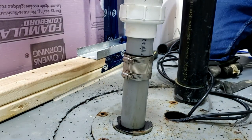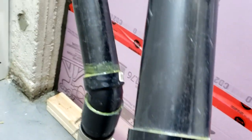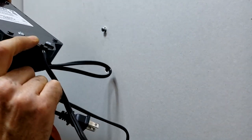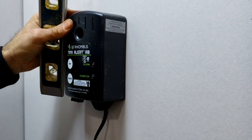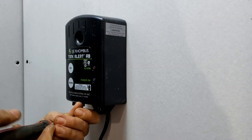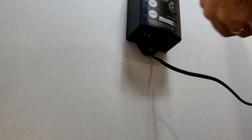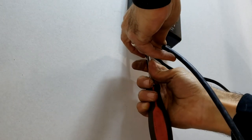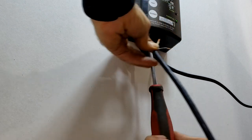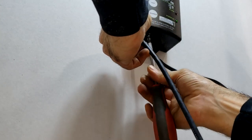Simple matter of connecting the remaining piping. Once your entire piping is assembled, we can proceed to tidy things up and do the test. Find a good spot for your audible float alarm that is accessible and also near a power outlet. Be sure to supply and install also the 9-volt battery for battery backup in case you get a power failure. Proceed to connect the two terminals coming from the float alarm switch to the unit — the order of wiring does not matter because you're just making a circuit.